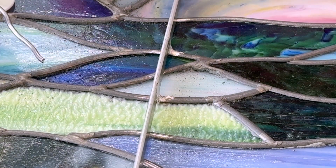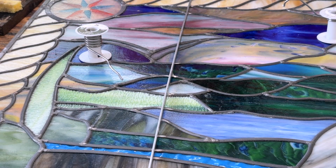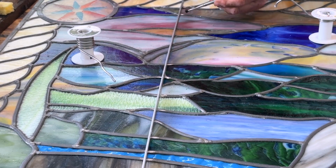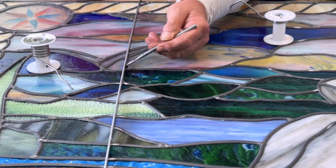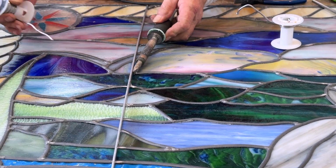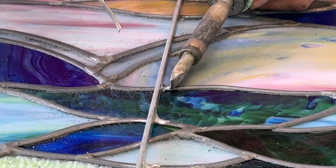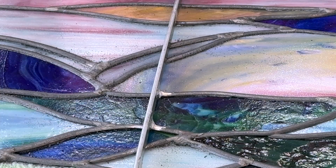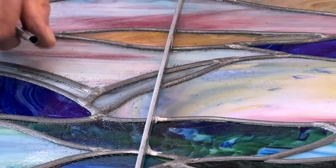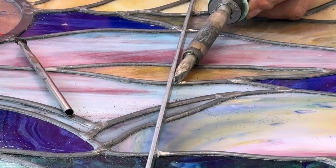Just like that, okay? So now these joints here, they're all set. We're gonna come down and we're gonna go ahead and attach the rest of these joints that are right here. Because you've basically what I call pre-treated this with solder, it's so much easier to just come back. Now that you've got that little mound there, lay your iron on its side, add a little bit more, and then bring it straight down and give it time to melt.